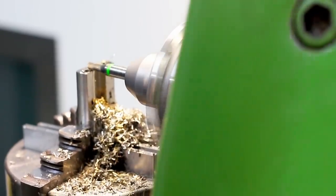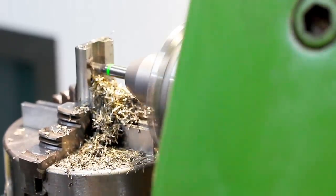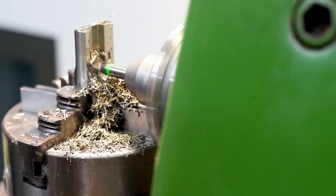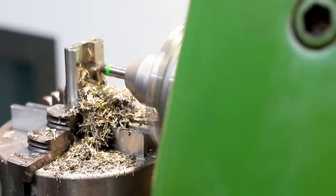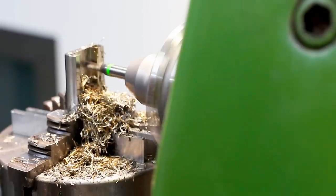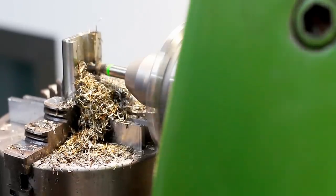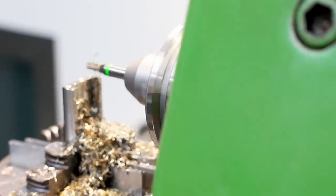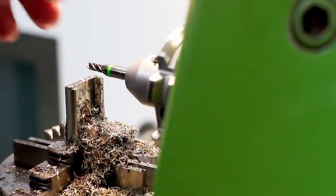And now we're breaking into the holes that we drilled before with the vertical spindle, which will result in this weird lockup geometry where a part will slide in later. Unfortunately, I don't have the part that slides in there as a sample part. I had to go by the dimensions of the real part, or the OEM part. That didn't take too long, despite it being a 4mm end mill.